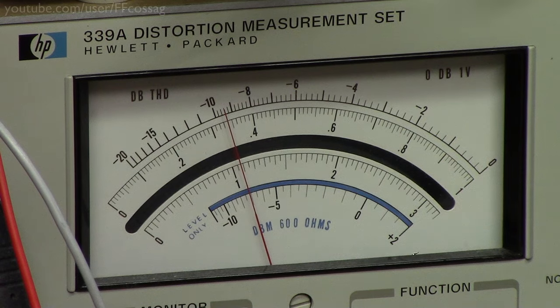So this just gives the amplifier a pretty, well, it gives it a subwoofer response, essentially, where it just gives you more amplitude the lower in frequency you go. It seems I can't really get this filter to behave very nicely, since it just seems to be incredibly unsharp. I'm not really sure how they managed to do that, given that they have four op amps here. Well, actually, it's pretty obvious, because they are running a stereo signal through all of the filtering, and they just mono-mix it in the end, which is just stupid.